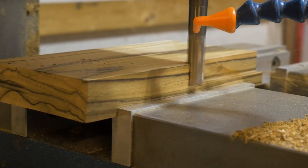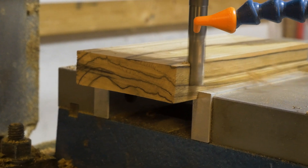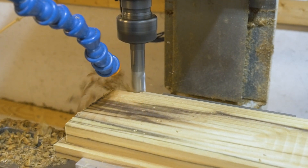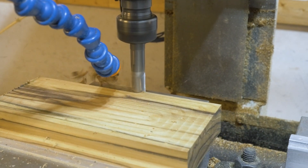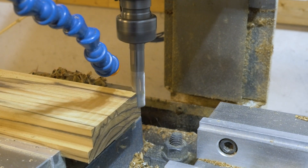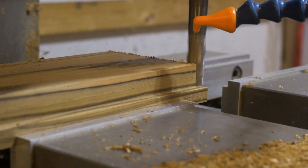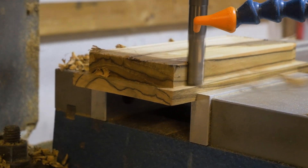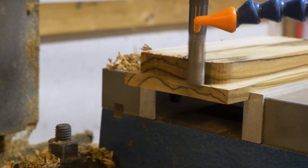This is like three quarters of an inch, a quarter inch step over, 3,000 RPM, 8 thousandths feed per tooth. And again, we're moving at 72 inches per minute — and it's not struggling at all. The surface finishes are amazing, it sounds great. It's just awesome to watch because I never see material get removed this quickly on the little PM30.